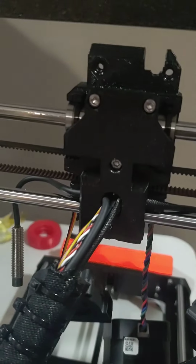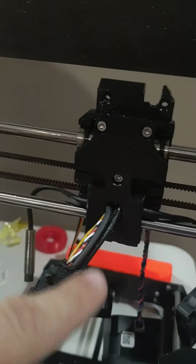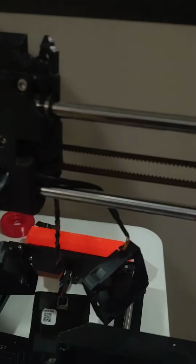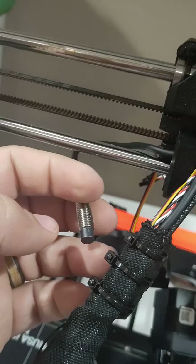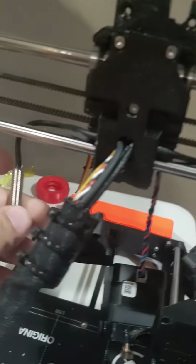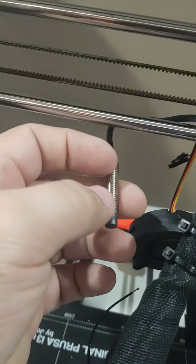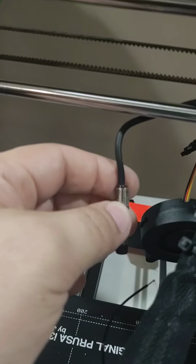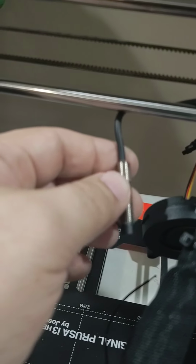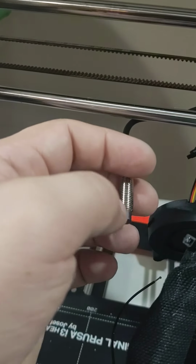And then I'm probably going to have to reference the Prusa guide on how to assemble the whole print head together again. I'm going to have to put the pin back on with the brackets, and that's definitely going to require a new calibration, because if this thing was just a millimeter off or a fraction of it, you're going to have problems if you don't recalibrate everything.